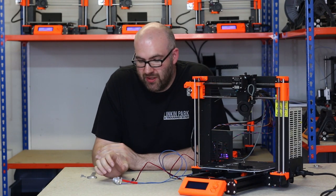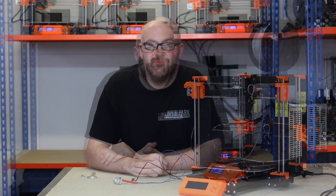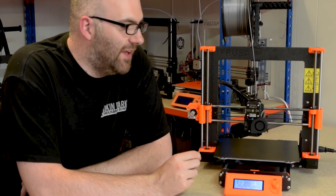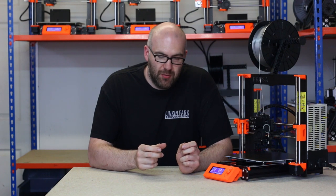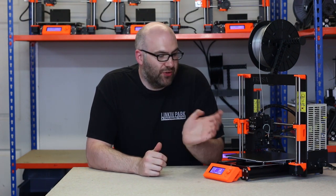So I'll hot-tighten the nozzle and install the new hotend back into the printer. I've completed the hot-tightening — that basically involved connecting up the hotend to the machine, telling the heater to heat up to around 270 to 280 degrees, and then with a 7mm spanner applying just finger-tight pressure to the nozzle, which is enough to seal it against the heat break. I then allowed everything to cool and have installed the completed hotend back into the Prusa printer.